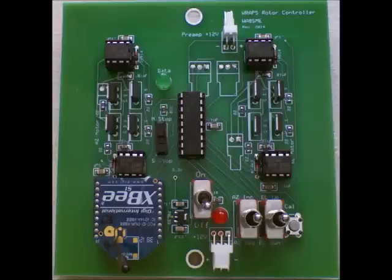This is the printed circuit board of the RAPS project. There are some surface mounted components in this project, but these components are relatively large by surface mount standards and are fairly easy to solder manually. The board is designed to replace the cover of a 4 by 4 inch utility box, which serves as the housing and support structure for the rotator motors.